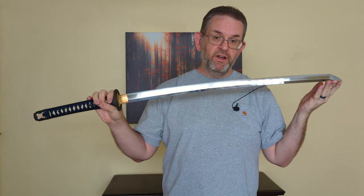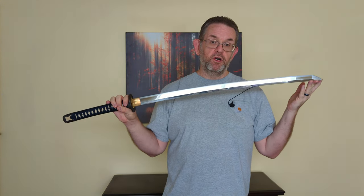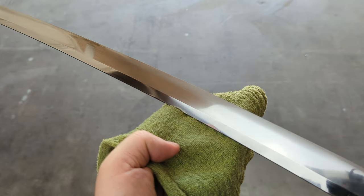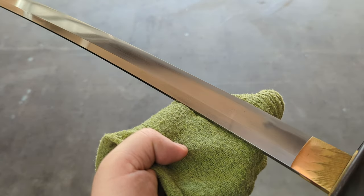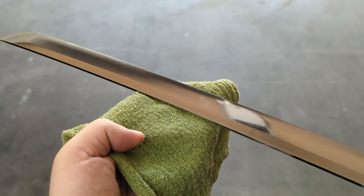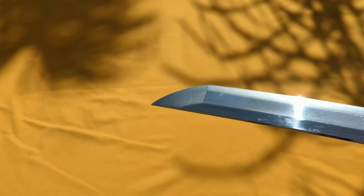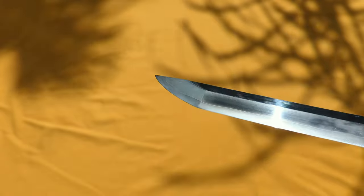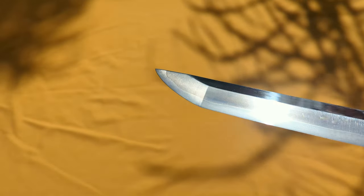This is a very thin blade for a katana, and it's done like that intentionally as a competition cutter or grass cutter. The hamon on the katana is rather subtle. It's not flashy by any means, as is normal for a suguha-style hamon. There is a noticeably prominent line, one that reminds me of the lamination line you'll see on kobuse katana. This is all monosteel L6, however.